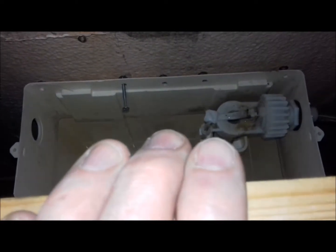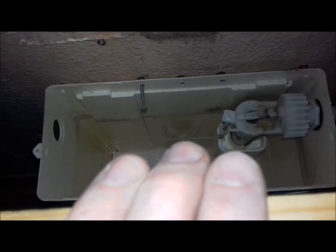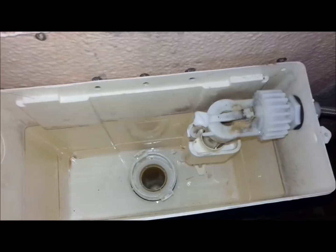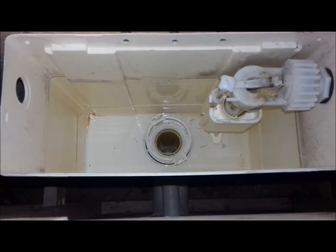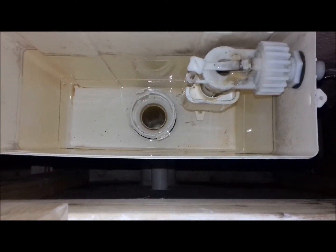Right, everybody, I just played that video clip back to myself when I stuck you under the tank, and as you will have seen, bloody annoying, just the tiniest little leak on that. I bet I probably just got to get another quarter of a turn on that nut. I was trying not to over tighten it, as I couldn't see under there, so I was thinking don't over tighten it and strip the thread, but it obviously needs another quarter of a turn. So back off with the tank and see if I can get on that and give it just that little bit of a nip up.